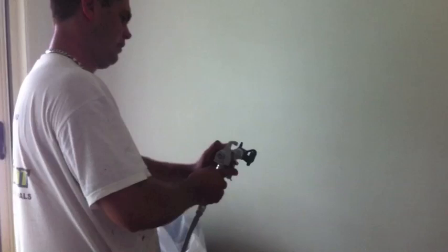G'day YouTube, just a quick video on spraying cornice. I'm using a 211 fine finish Graco tip with a Graco attachment head on a Wagner gun. My spray is a Wagner Project Pro 119, which is the bottom of the trade sprays, but perfectly fine. I'm using a fine filter, and because I'm using a fine filter and a fine finish tip, there's going to be minimal overspray on this job.